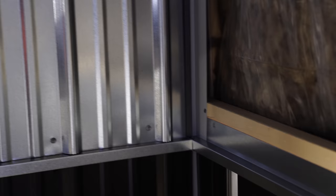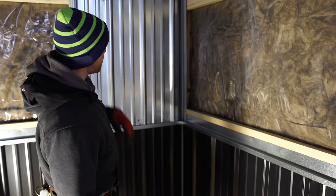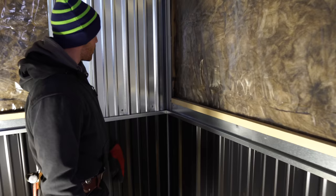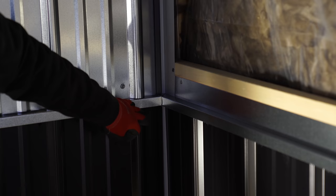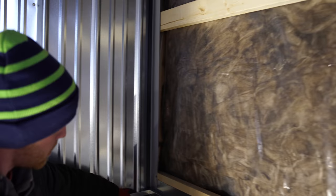Right, but I think most importantly, like what we're doing here with our ribs and the layout, like you were saying. Okay, so what we're doing right now with the ribs is we're lining them up with the outside. So that way if he wants to drill a hole through here, it's right through the flat here and right through the flat outside. And so we went back, I think it was like 6 inches or something like that. Yeah, it's about 6 inches. And then what we're gonna do now is, we talk about the corner trim? Or the D2? I think just showcasing that, we're gonna run that side steel first. Then we're going to cover, because people always want to know what our interior corner detail looks like. And I was just going to have you talk through that. But I think maybe what's best is if we go ahead and do this and then come back and kind of showcase it.